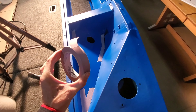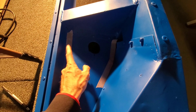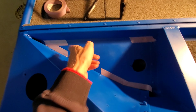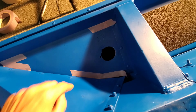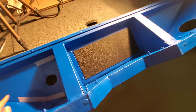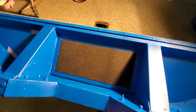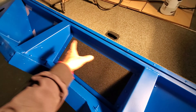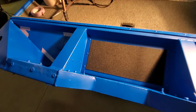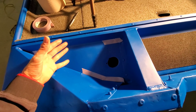What I'm doing with the tape is marking it flush with the corner, which signifies an inch. That gives me a corner to measure from here to here and from here down, so I can recreate that shape and give me a nice reveal. I don't want everything going corner to corner — I like the look of having a surround, a picture frame to it. So we're going to get a little decorative, and I'm going to measure it out and transfer it over.